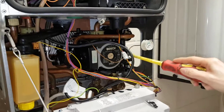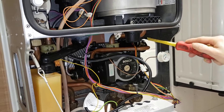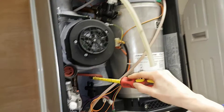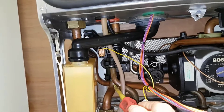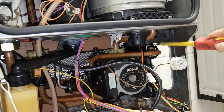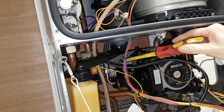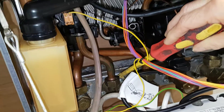When the pump starts, the circulation will go around the top here on the return, all the way around through the heat exchanger and round through the flow pipe down here. It will then go through to the flow unit, and at the same time the cold water will enter through here to the plate heat exchanger - there are opposite ends and the heat will be transferred as it goes across. The hot water will then come out of the hot water outlet there.